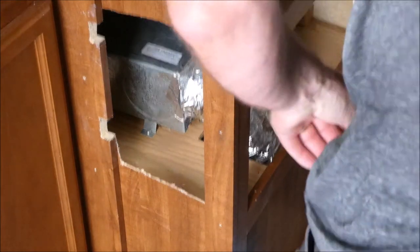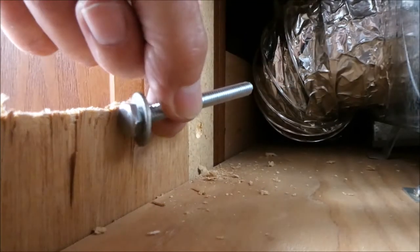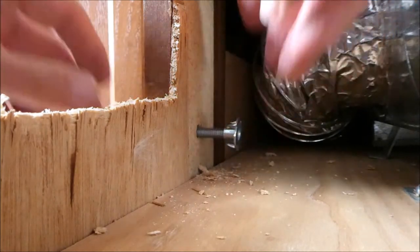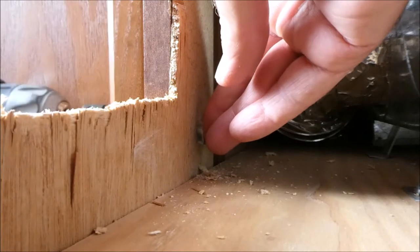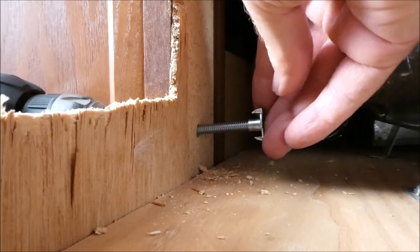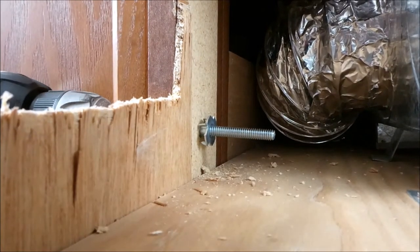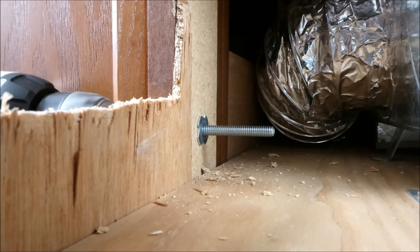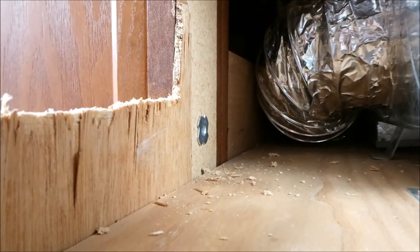Double check — great, good to go. To install the t-nut: put it through the hole, thread the t-nut on there, take the drill in forward or clockwise. This is going to draw these teeth into the particle board. Now I have a method of driving this bolt through and attaching my panel on there. Next, I need to drill these three holes out so that my quarter inch bolts will go through. These three over here are going to just get wood screws into the particle board.